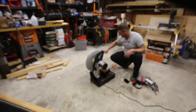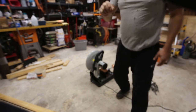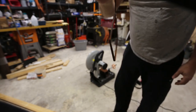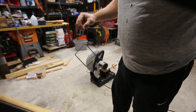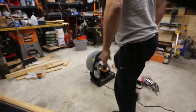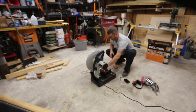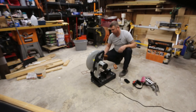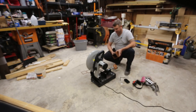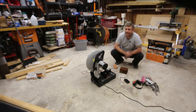Hey, that's kind of hot — pick it up by the shaving. This is a really thin cutoff, and you can see it's just a little bit thicker on one side than the other, so it was out of square. What we're left with is a really square block. This is going to be a really efficient tool for doing prep work for fabrication because I can cut stuff really fast, and I always used to dread doing all my prep cuts. Your welding is only as good as your prep.